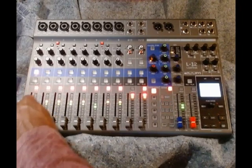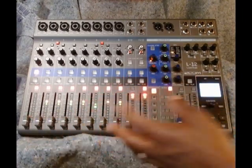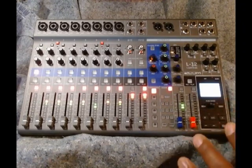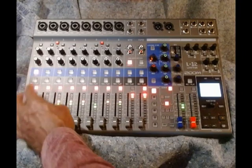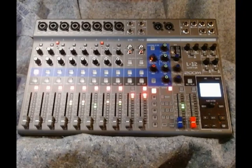Okay, so now, what you have to do is you have to go up to the LED that's there, come back down, and now the fader is activated. You're not going to hear anything at first, and that's a safety measure, because if you popped in a new preset and it was all wacky and crazy, you might have somebody on a microphone. So it's a safety measure. What you want to do is get used to that throw up and throw down, okay? Throw it up. Pull it down, and now the fader is working, and now you can adjust the mix to whatever you want it to be. And put it where the LED was, and it'll be that preset, okay?